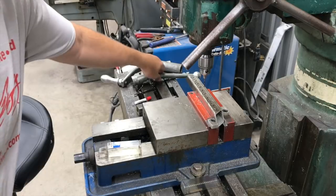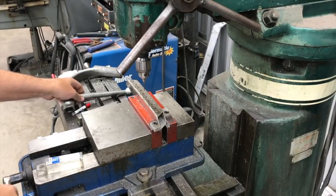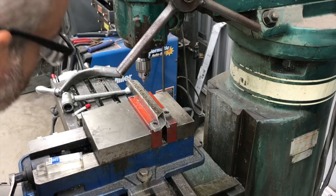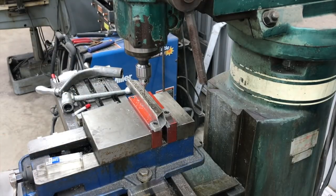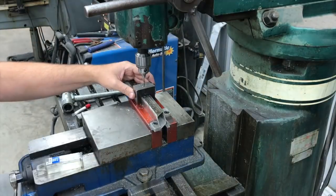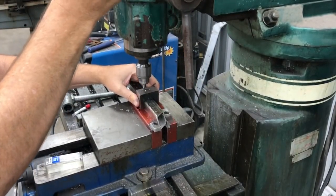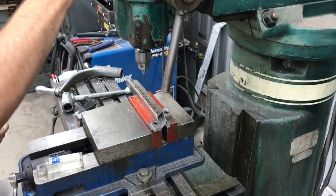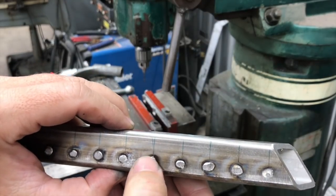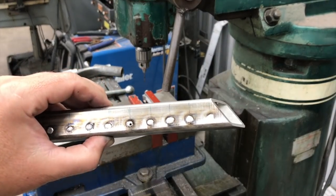The big bulky vice handle is just in the way, and you can see I've got a chair — I've got so many of these to do, I'm sitting here for hours at a time. It's just better to sit down, get comfortable, and get in close with a wrench. I'm getting the drill lined back up with the mark and tightening down so it won't walk, then we've got our drill guide with a little bit of lube. It drills really, really nicely. I can see the weld and I'm able to get the hole pretty well dead center and keep it from walking.